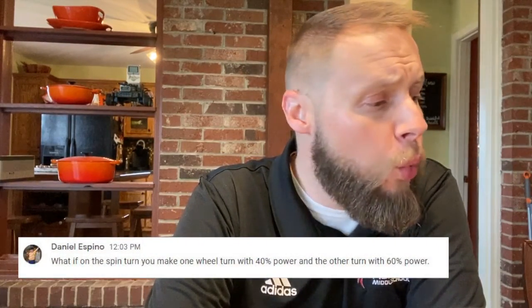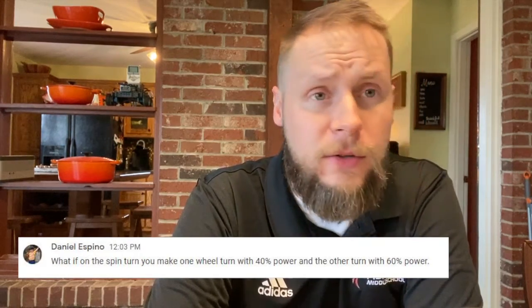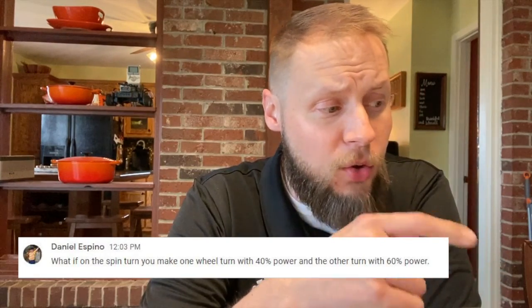All right. Our first question from yesterday's videos was from Danny, and let me read it. It says, what if on the spin turn, you make one wheel turn 40% power and the other wheel turn 60% power? Now, I love the question. But if both wheels are turning positive, then it's gonna go kind of like a staggered straight. But I think what you meant to ask, Danny, was what if one wheel was 60 and one wheel was negative 40, or vice versa.